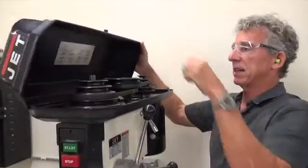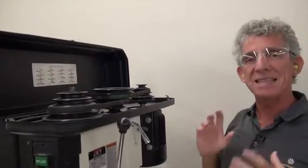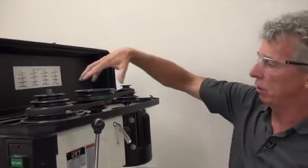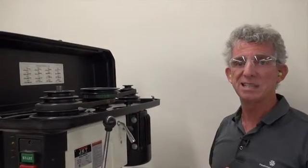The drill press can be set for different speeds. So here's the different gears. It's kind of like a bicycle with your bigger and your smaller wheels. We have it pretty well set for standard drilling, but if you need to do specific things, if you were going, say for an example, onto a really, really hard wood, we would want to change the speed.